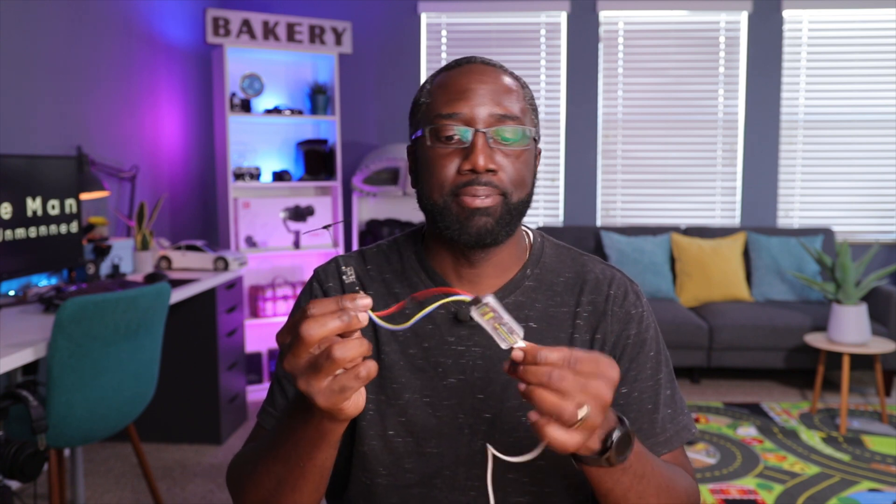I just saved myself $13 to $15. It's almost impossible to permanently break an ExpressLRS receiver unusable when you have a dongle like this — you can probably recover everything. So this is not only good for testing receivers, it's also good for flashing. I prefer flashing via WiFi and now have that option again, but the only way to recover bricked receivers is through an FTDI adapter.